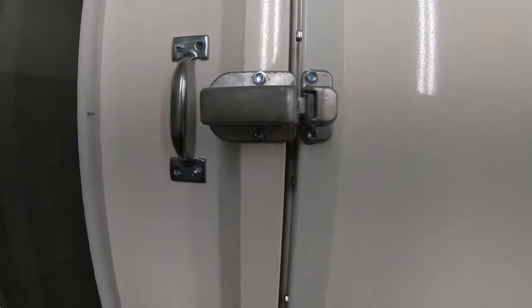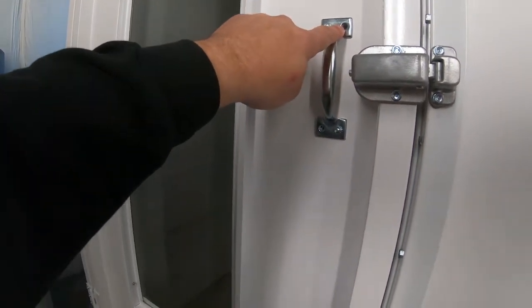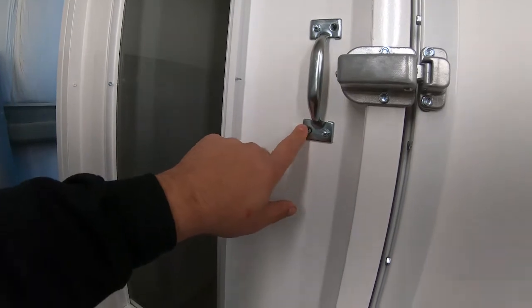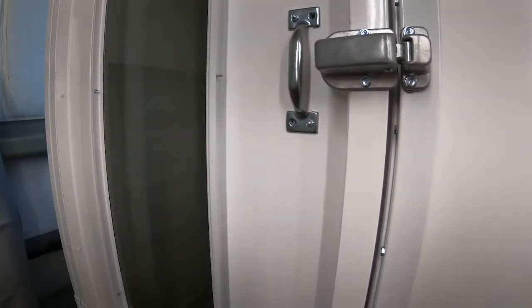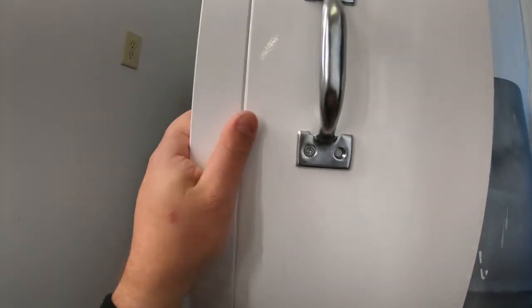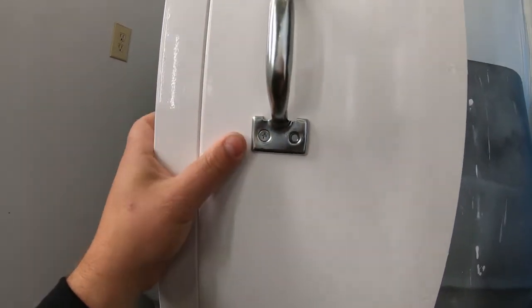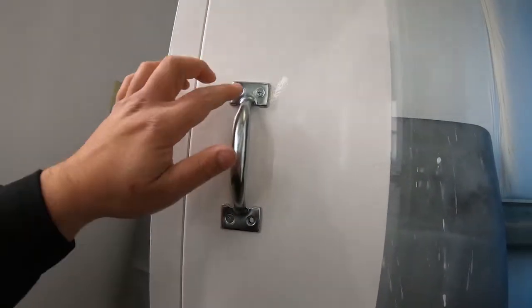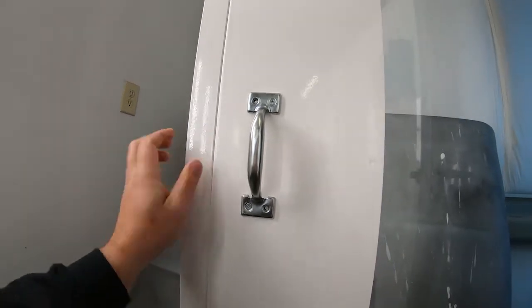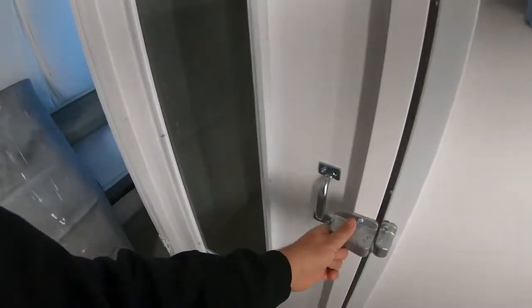You can see it works pretty well. The holes are already pre-drilled for the handle, but they aren't exactly quarter inch so you can force the screws or drill out the holes bigger. The screws they give you are only half inch — not deep enough — so you can switch to a three-quarter to one-inch screw, or do what I did and go to the hardware store and get some countersunk Phillips head screws. I could only do one side so I chose the inside for the nicest look. I only got two but there are actually four holes, so I just have them in the corners for now and I'll go back to pick up two more.